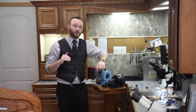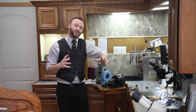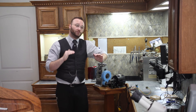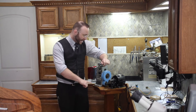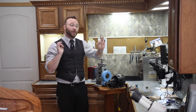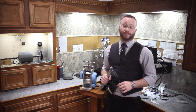What that means is that it is incredibly high torque without being so fast that it'll shoot pieces out the back. It's important to have enough torque to move the rolling mill no matter what, because rolling mills don't have to roll quickly — they just have to roll smoothly. You have to have something that can reliably move those gears and rollers so that anything you put in one side comes out the other side, guaranteed.